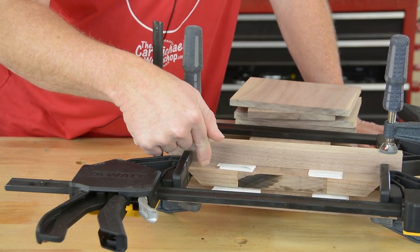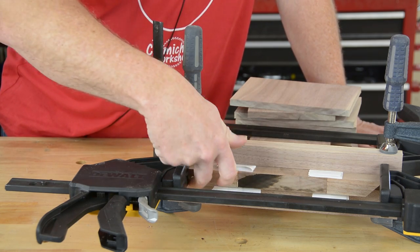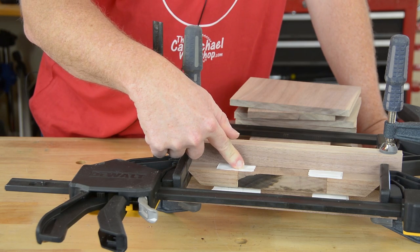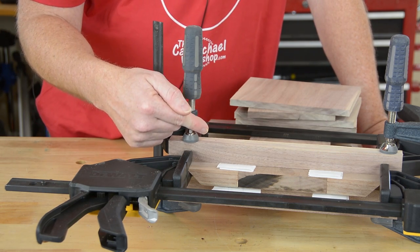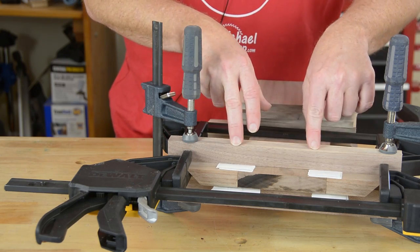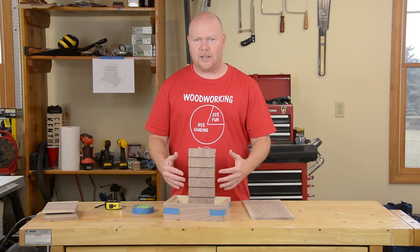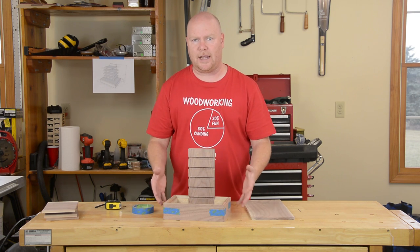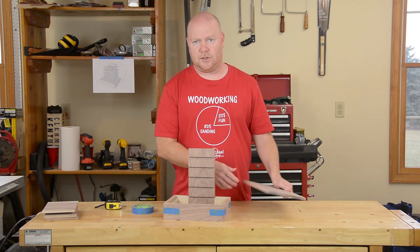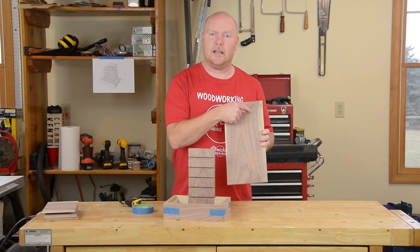As a sub-assembly step, I went ahead and glued these mitered wing pieces onto the upright post. That's a giant pain because they have miters cut on the ends. If you have a doweling jig, the easy thing is to just put a couple of dowels in to keep everything lined up and straight while you clamp it. I don't have a doweling jig, so I put cauls on top and bottom to make sure everything stays flat and lined up while I put clamps on the ends to apply pressure to the glue surface. With the back of the base unit now solid, it's easy to just tape this mitered box together and see how square it comes out, and more importantly, see the exact dimensions for the lid — it looks like we need 9-3/8 by 6-3/8.